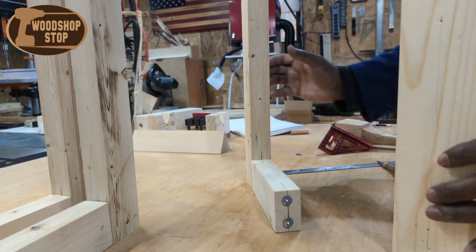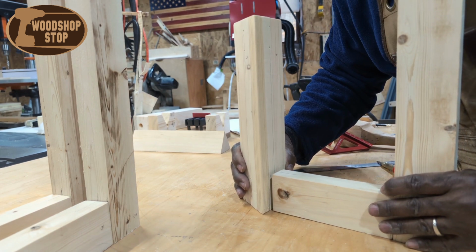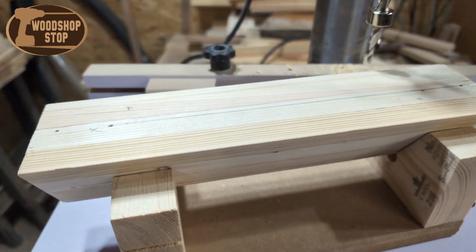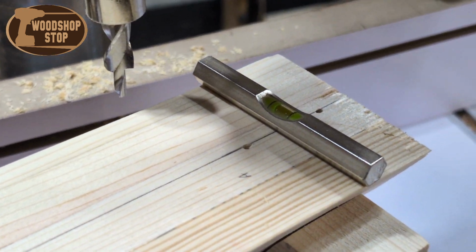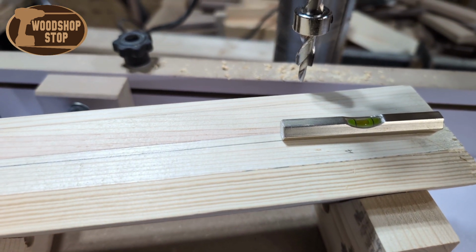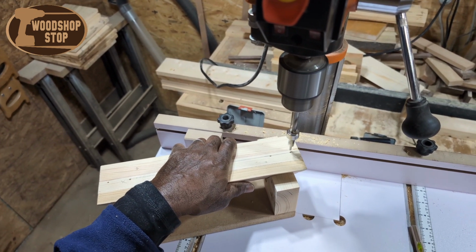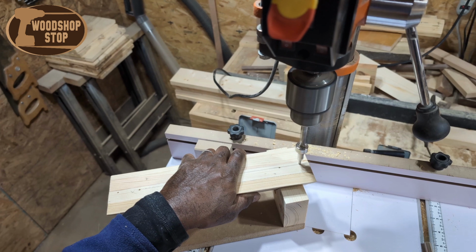If you had any questions or doubts about the setup or the design factor. And here's another view of the transferring of the dowel hole positions onto the three-sided board. Now it's time to cut the three-sided board and put the dowel holes in their locations. I have to make sure that that face is level in both directions, so I created this jig or fixture that I could set this three-sided board into. If you'd like to see how I did that, there's a video for that on my channel as well. But it seemed to work out okay.